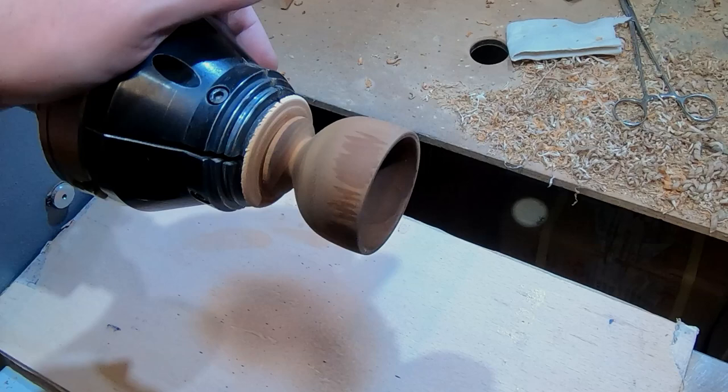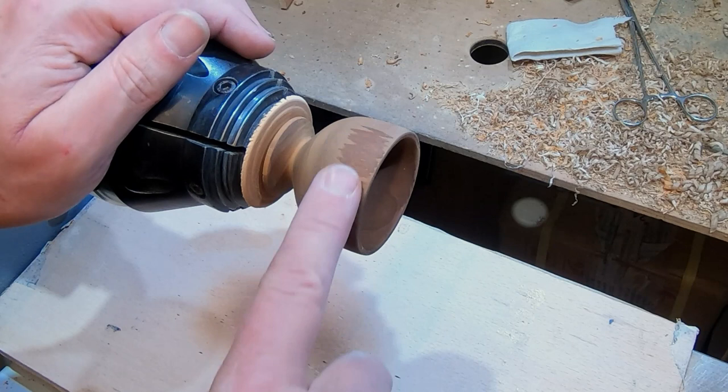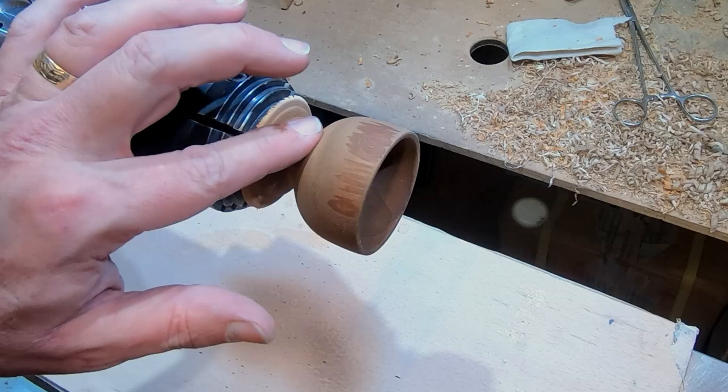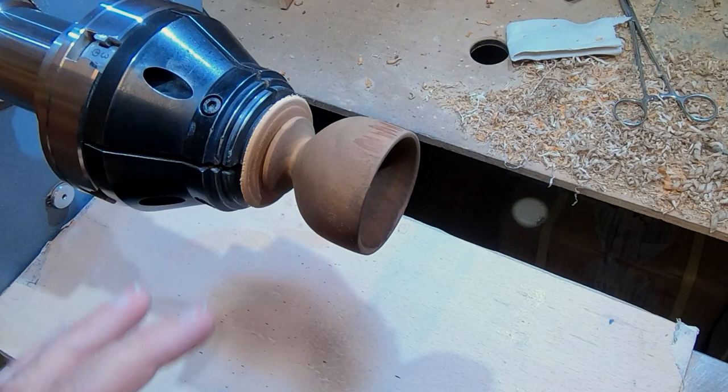And I've left this to dry for a few minutes, and so hopefully you can see it's just got a fairly uniform sort of dull brown colour to it. I've got the highlight patches for where the bark is. This dark patch here, I don't know how well it shows on the camera, that's sort of where the grain has lifted. So that's a bit of a rough bit there. And the inside, it sort of looks dark in patches, but if you stick a torch on there, it's actually dry. So I'm just going to knock this back again with 600 grit paper.